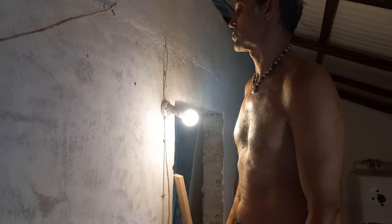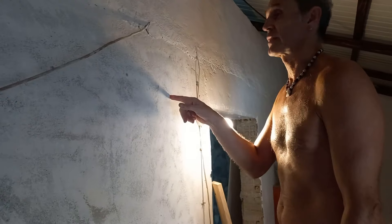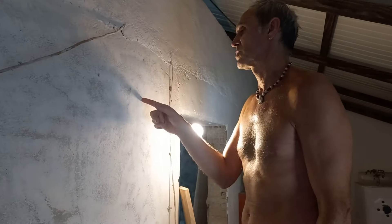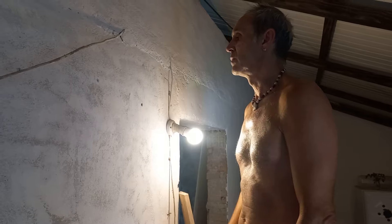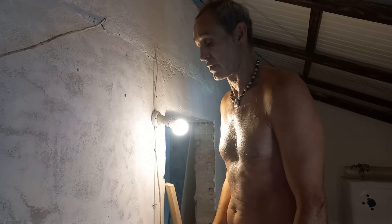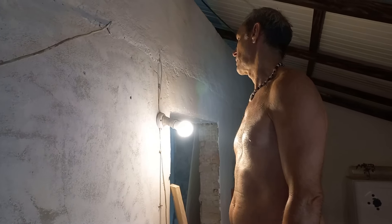So far it seems like a fairly solid wall, which is surprising. It might be going into some of the mortar. Once I get the hammer drill in, you'll be able to tell — but I want to make pilot holes anyway so I can hammer drill in.